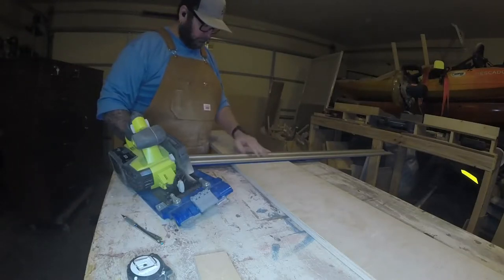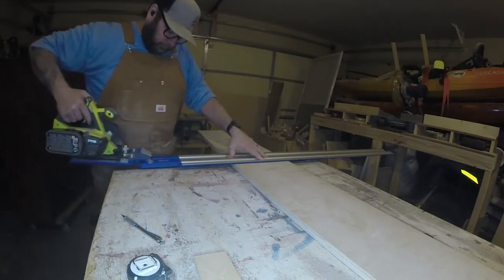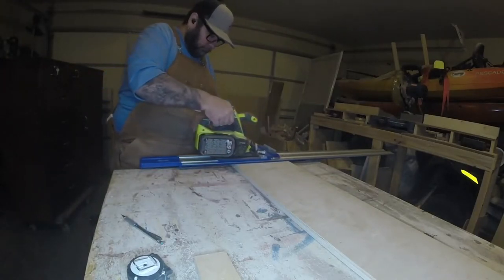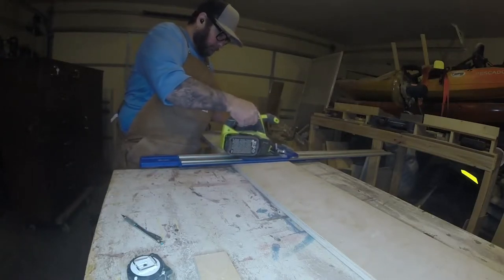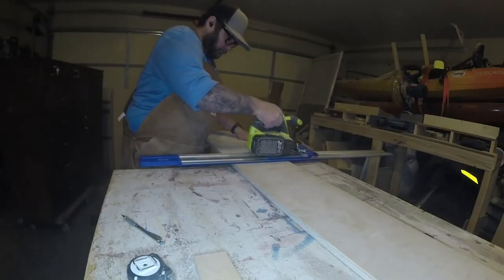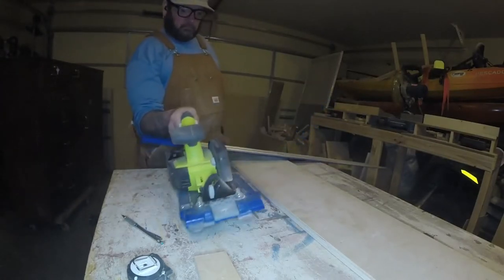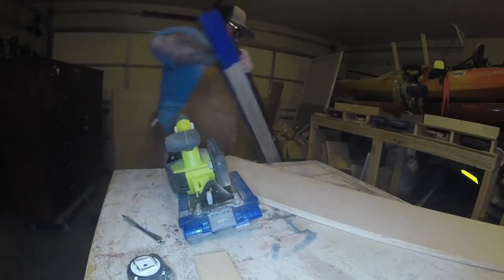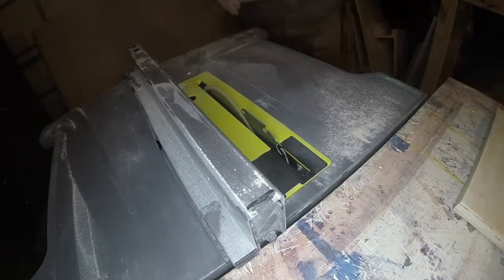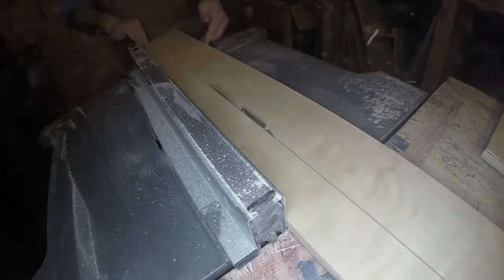Since this is ten inches wide, I use the track saw a lot and will be using it a lot in these videos until I get a new miter saw — my miter saw will only cut about five and a half inches. So anything over that I just use the track. It works great. I have that little Ryobi battery-powered circular saw on it and it cuts through everything just fine. The Kreg AccuCut is pretty accurate.